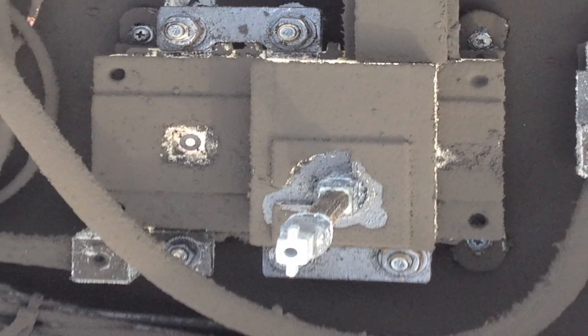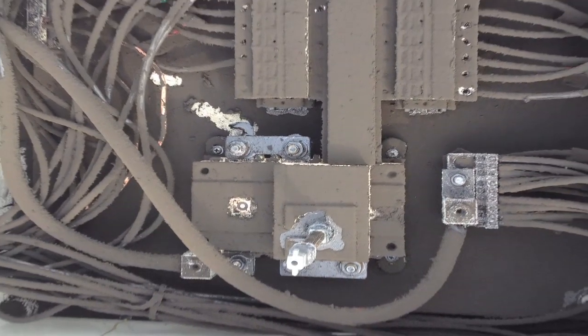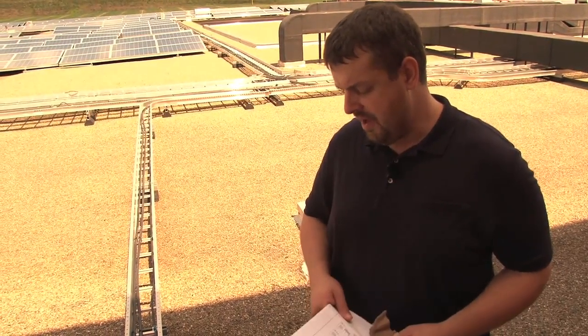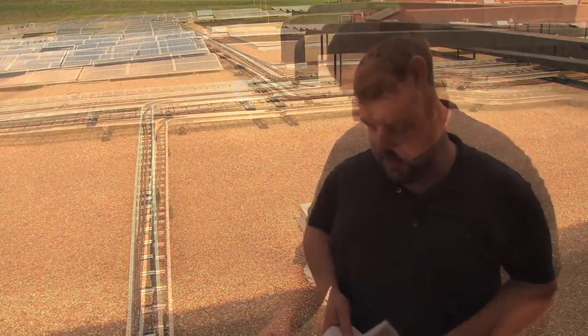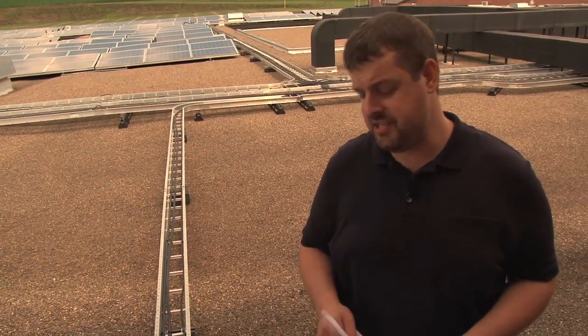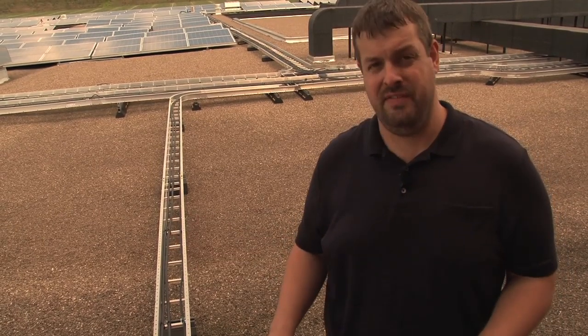Another one that's not too common but has happened is that the handle on the top of the box has leaked. In this picture you can see that water leaked down onto the switch and has arced over time, leaving soot and burn marks all inside this box. This whole box has to be replaced before we can do final approval. This is not an installation problem — this is a manufacturer's defect. Inspectors are approving the equipment and the installation of that equipment, so we have a responsibility to be looking for manufacturer's defects.